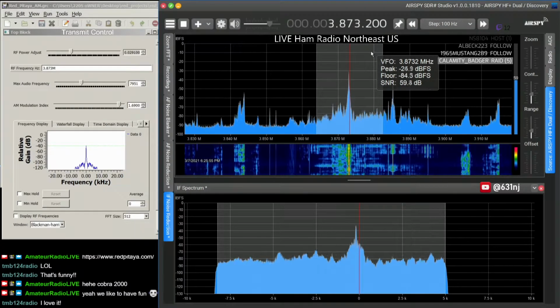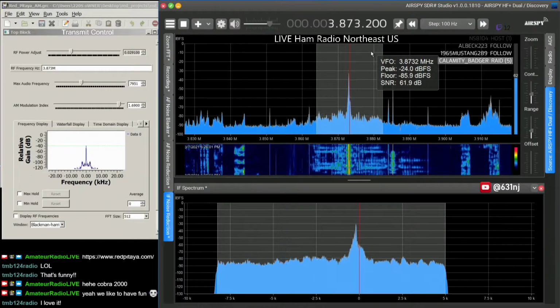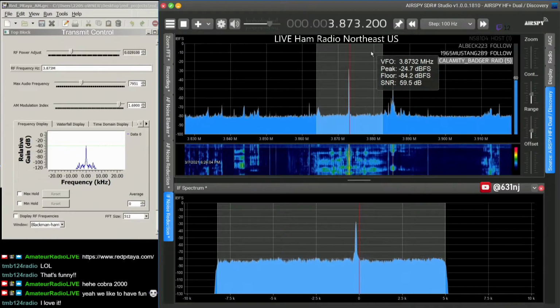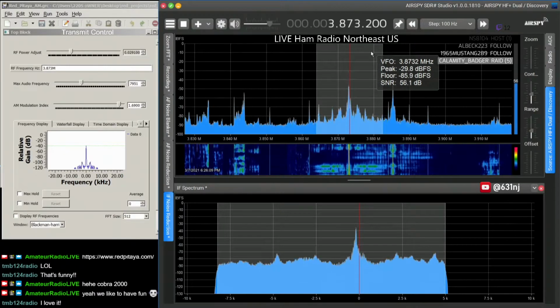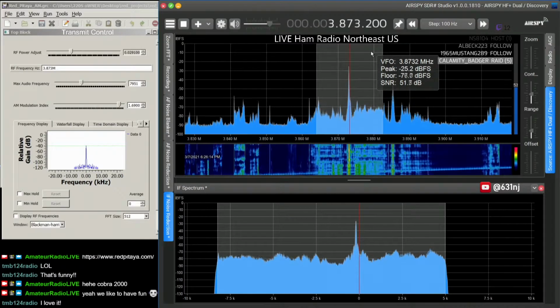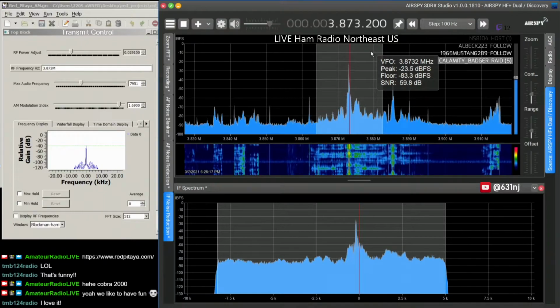Oh, and I forgot to mention this Class E rig is only driven by 2 watts. Only need 2 watts to drive it to 1500 watts output. So it's very, very efficient. 97% efficient. And I can do 200% positive peaks and 98% negative peaks. Anyway, go ahead, Jim. K1KBW.